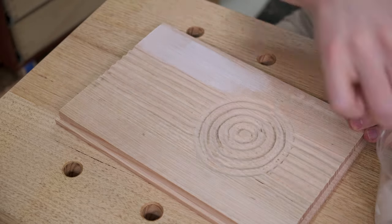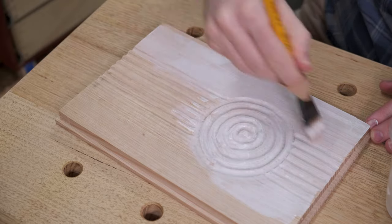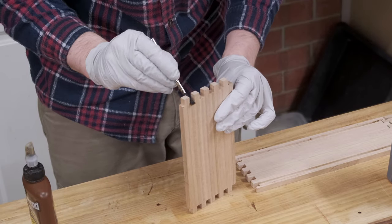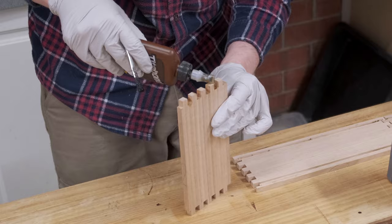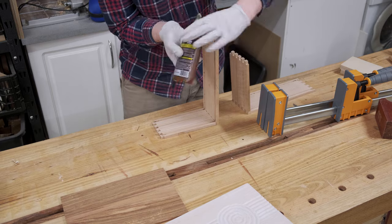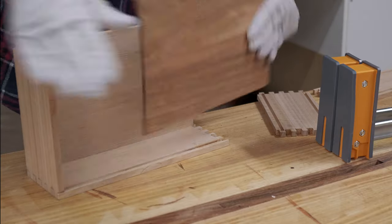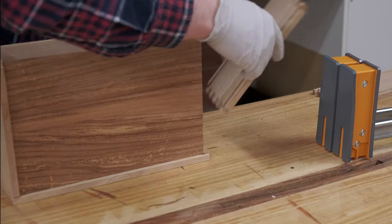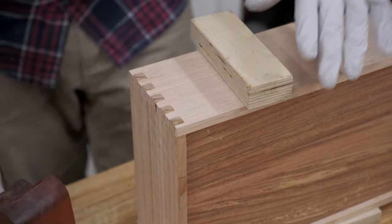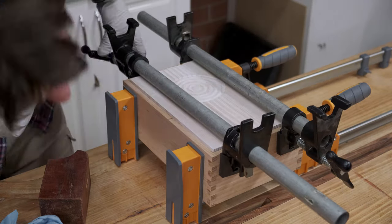I used a thinned-with-water coat of gesso to lime the panel — it sort of worked. Normal PVA wood glues contain water which will swell the joints slightly, which can cause it to be very difficult to close up box joints given there are so many of them. On the other hand, liquid hide glue, which is what I'm using, lubricates the joints. The clamps were there because one corner didn't seat 100% correctly with just hand pressure.